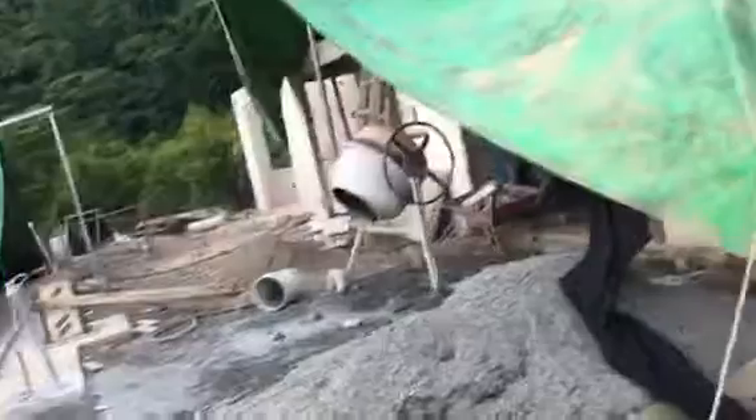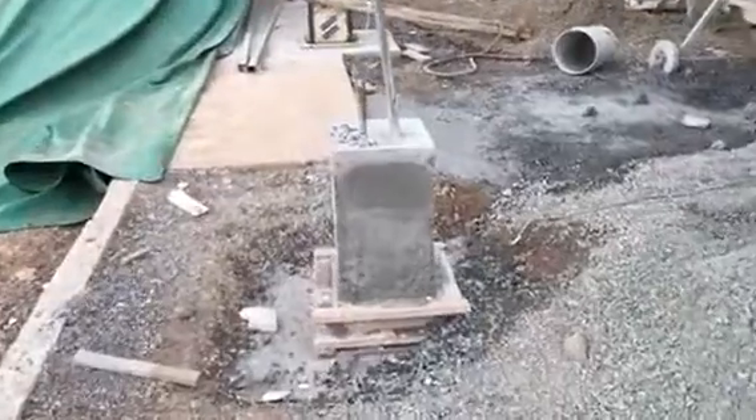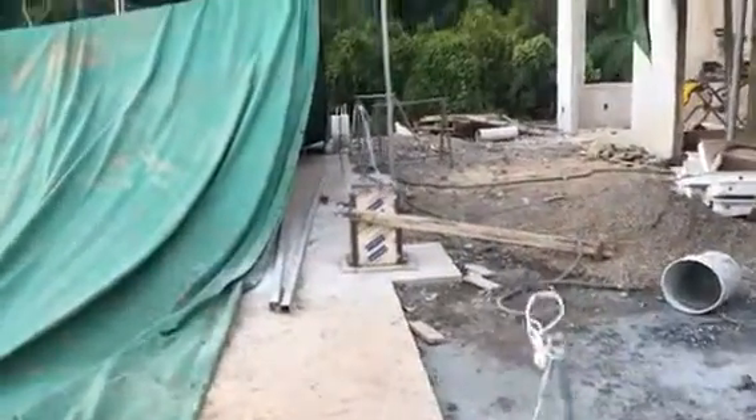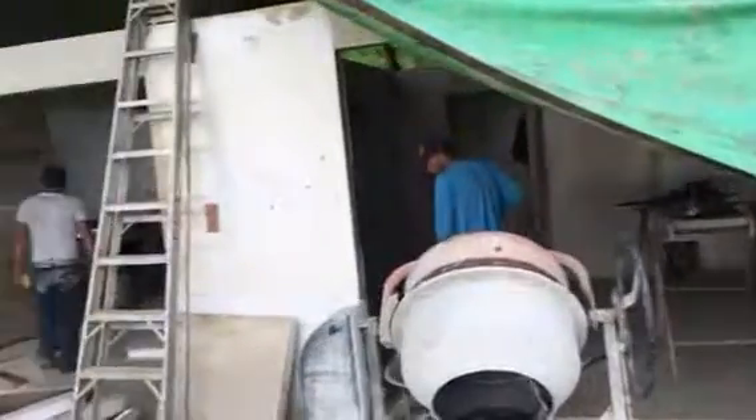Side view. Next week we're putting up our other tarp so that we can be much more dried in. Our pedestals are near — we've got one left to do. This is the right side with the patio doors in place. This one's already been capped off. And this is a glue-lam beam in there to kind of bridge the weight over the large door opening.